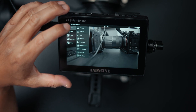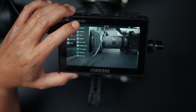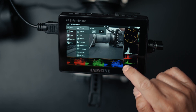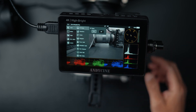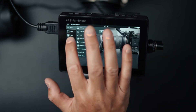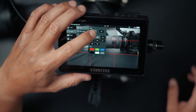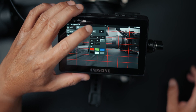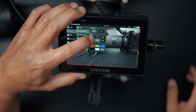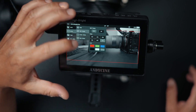There's a great Assist feature that gives you all your waveforms, histograms, and so on. If I go to All Waves and turn it on, you'll see all the different features for measuring how the picture looks. I can turn off the waves and it goes back to the standard screen. Under Marker, you can show grids — 3x3, 7x7, and so on. You can also do safe frames to show safe zones in case what you're displaying on will crop the image.